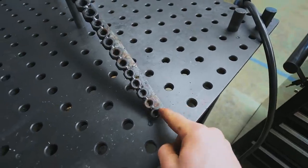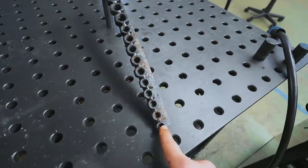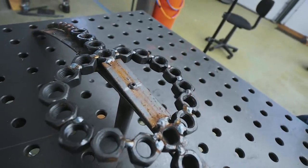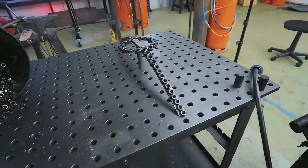There's a little bit of a crossroads about whether I start from the inside and go out, or from the outside in. What I did do to help myself is I've drilled and tapped so I could install a bolt here, so I can spin it around that central axis — and hopefully it'll actually end up coming together in this hemisphere shape. This certainly stumped me for a little while as I've been trying to work it out.